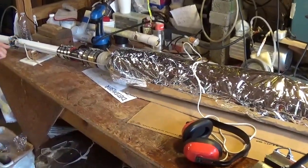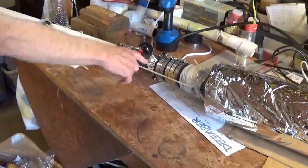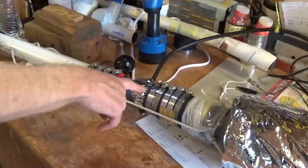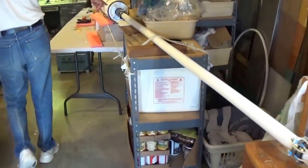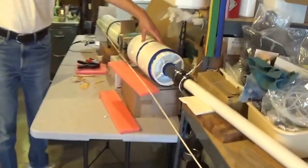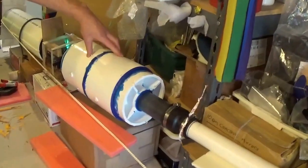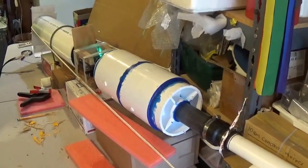The rest of it is similar to what we showed in our vacuum only video. The ping-pong ball sits here. We have a membrane to hold the vacuum at this end. And then the 10-foot, 3-meter-long launch tube. And a vacuum chamber here, which gives a place for the air that leaks by the ping-pong ball to go, so it doesn't build up back pressure against the ball.